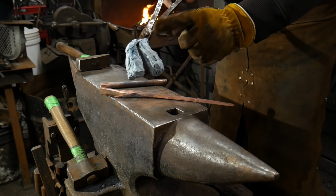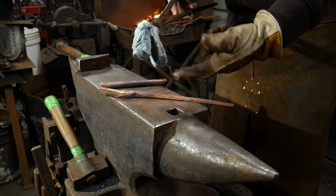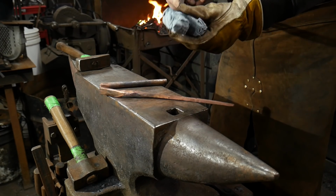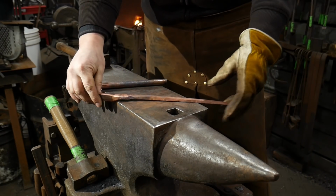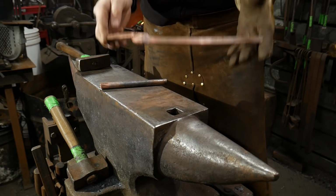One way of doing that real quick, if you do have a pair of steel tongs and you're trying to turn them soft, just wrap some terry cloth towels around the jaws themselves, get them wet, and that makes a great option. They stick right on there. And those are just like your standard blue mechanic towels, blue shop towels. So that's the reason for making these.